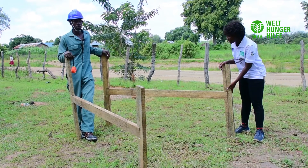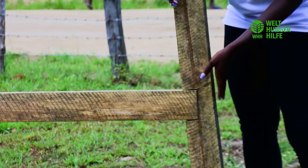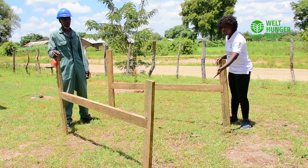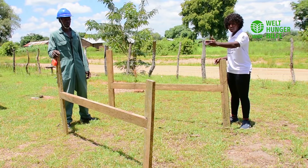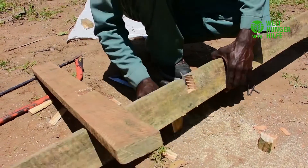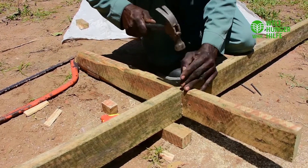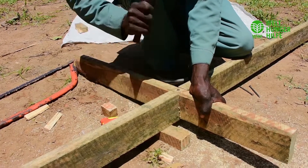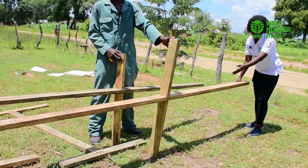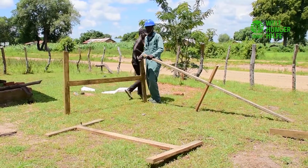We have now finished making the stands, and this is how they look. You can see how the notch joins the two timbers together to enhance the strength of the solar dryer. Next we are going to make the frame. We will put another timber to join the two stands together to come up with a joint frame. To do this, you get a two by one piece of timber which is ten feet long and another four by two piece of timber which is three feet long, then create notches on both of them and join them together. This is the front and back connecting timber — because it is too long, we created a support in the middle. Next we are going to connect these two stands together to come up with the full frame.